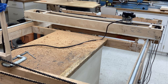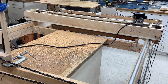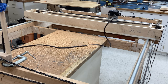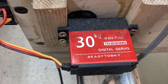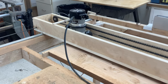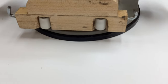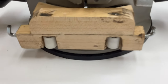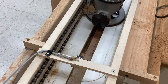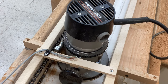Although I didn't have another project in mind, I decided to build a 2.0 version to fix the most annoying issues before putting it in storage. I reworked the router drive to make it much faster by replacing the threaded rod drive with a bicycle chain drive. I moved the servo from the end to the side and connected it directly to a 13-tooth sprocket. An identical sprocket at the other end of the sled returned the chain. I reworked the router fixture so a pair of springs connected it to the ends of the chain. Rollers were added to the fixture to prevent the router from grabbing the sled sides. The spring kept the chain at the right tension and absorbed the shock when the router hit the hard stop limits at the ends.